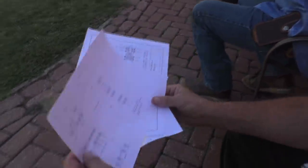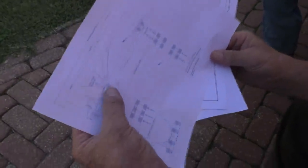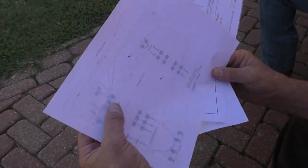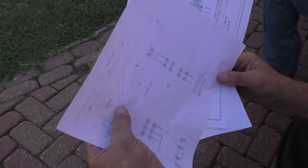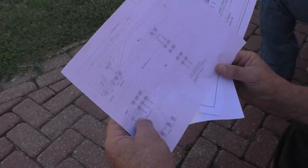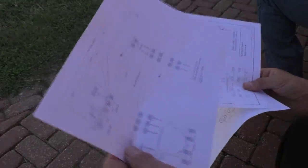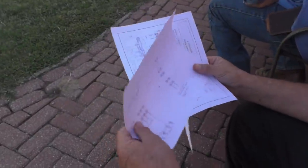I see. There's a couple different height fifth wheels. A lot of heavy haul trucks are going to have a 54 inch fifth wheel. He's already got them. I'm pretty sure it's 54 or 58. Okay, we're at 50. I think a low fifth wheel would work. If you're really low geared, it's a lot easier to back up. You can do your corrections easier. You got more time. You don't have to start and stop so much. But a good driver will be able to do it anyway.